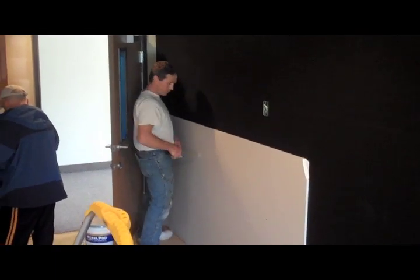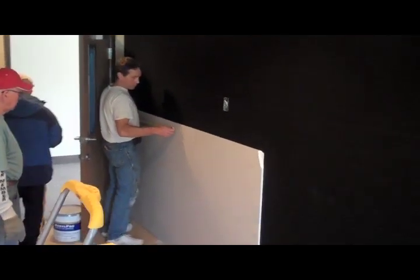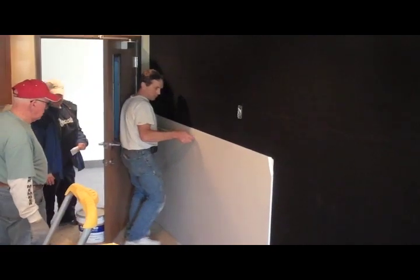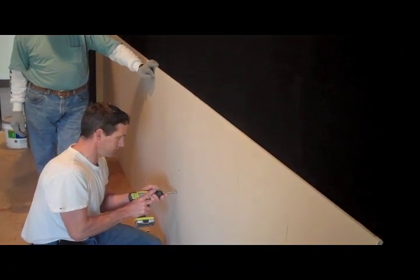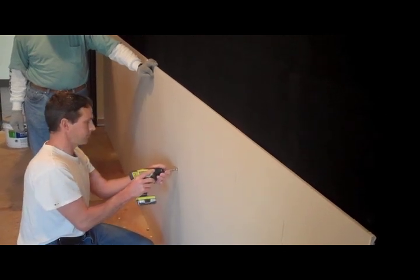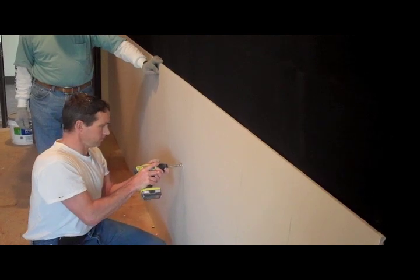When sound vibrations hit the wall, MuteX acts as a shock absorber, preventing the energy from transmitting into the 2x4 and then into the wall in the adjoining room. As an added benefit to installers, MuteX will not bind around drywall screws. Also, MuteX gives your drywall screw something to grab if you miss the stud and need to back up and try again.